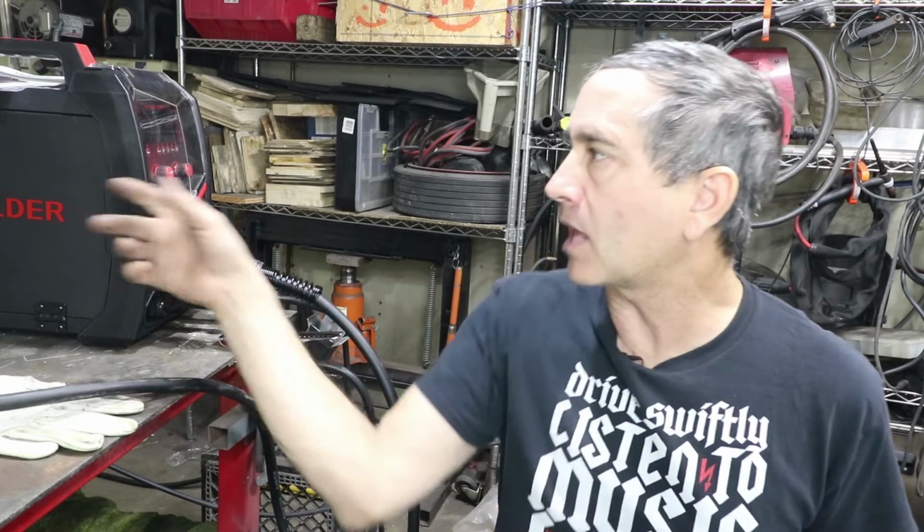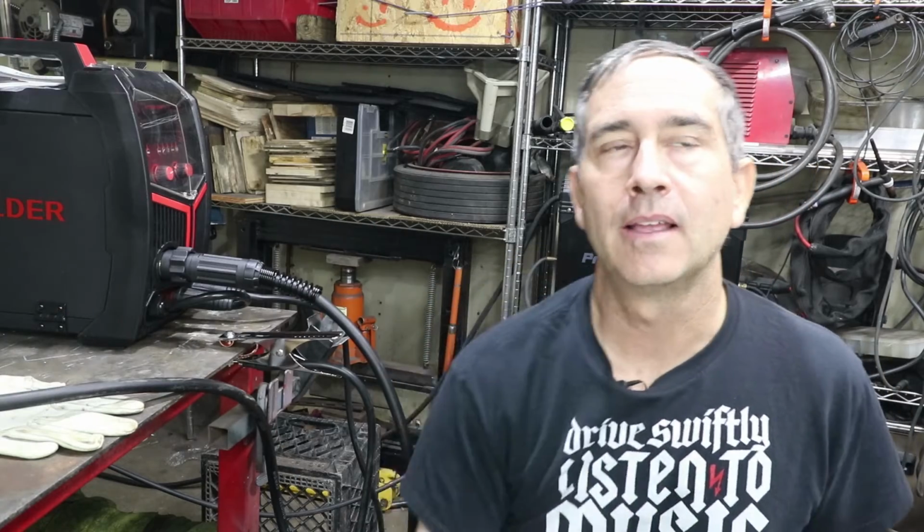We tried aluminum welding. We did not try aluminum in this spool here. That requires the different alloy 5356. And we tried some steel welding, and I think it's perfectly normal as a steel welder. It will do flux core welding. I don't have the wire. I used both types of gas. I used argon gas and the CO2 mix with argon that I just demonstrated here with the steel.